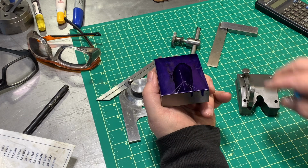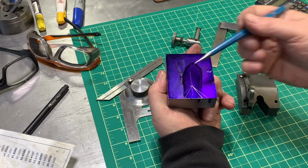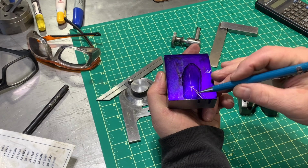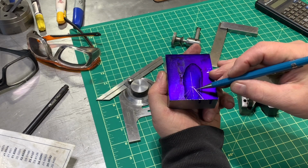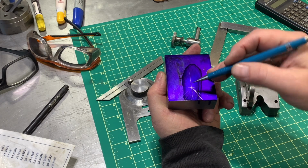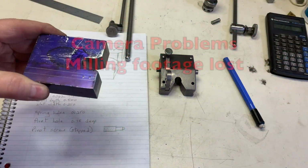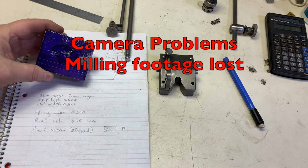the pivot. So as much as I would have liked to have done the 45, I'm going to do the 60 degrees. I'm going to carve in like this with a 3/8 end mill, and then just shave off the rest individually on each side. This is where we were when I left off.